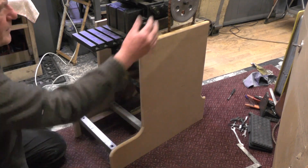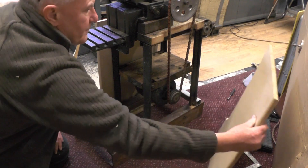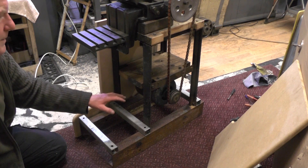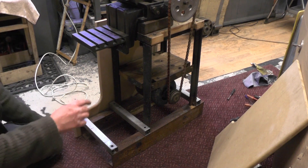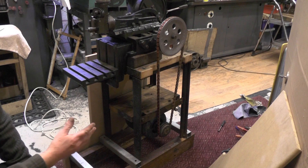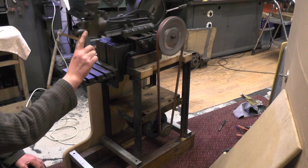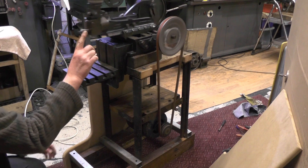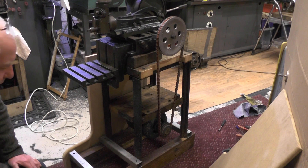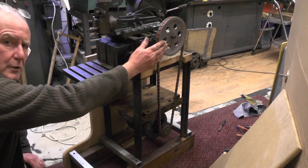All this has got to be filled in and the back's got to be filled in, it's all got to be painted. What I've been doing today — I took this motor off and slung it underneath the shelf on a pivot mechanism. I've just been measuring the speed of the shaper by counting how many strokes a minute it's doing, and it's actually doing about 100 strokes a minute with this arrangement of pulleys. I've got two smaller pulleys here — I may put one on or two on and make a triple pulley, leaving a single pulley on the top.